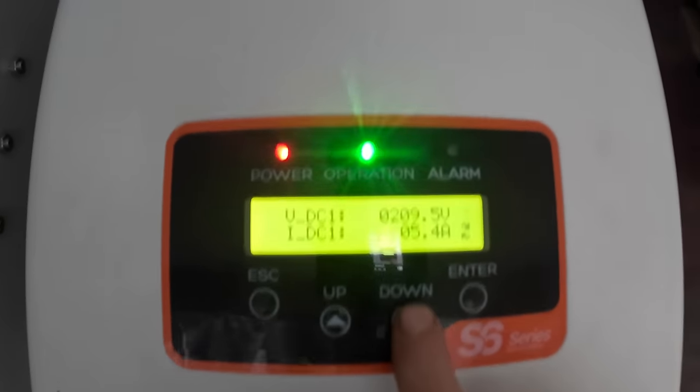Since yesterday we've generated 17.7 kilowatt hours — we had 6.4 kilowatt hours yesterday and 17 today, though I'm not sure exactly when the counter rolled over. All going well. I'm going to shut it down now because I've got a bit more work to do — I'm adding another control system. The dump load controller deals with overspeeding electrically, but if a belt fails or the alternator fails, the wheel can still overspeed.